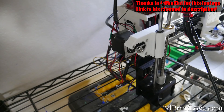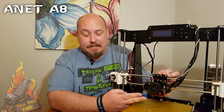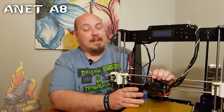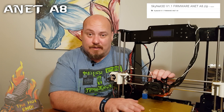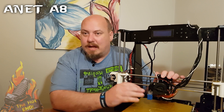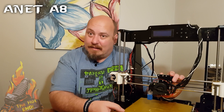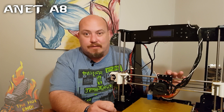One solution is what I've done here — I've installed the Tronxy proximity sensor. Once the bed was level, I popped this on. I've only had this running for about a month. To get it running, I flashed the firmware with Skynet 2.3.2, which is available on their Facebook group — I'll have a link below the video. Once the bed was level, I used that and never had a problem since. One of my next updates is to remove the screws altogether and have it permanently set at a certain height so I can just hit print. The Tronxy will take care of everything else.